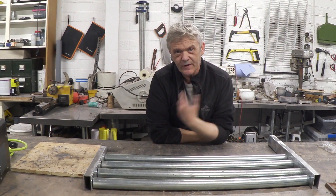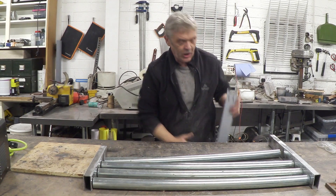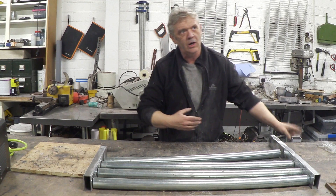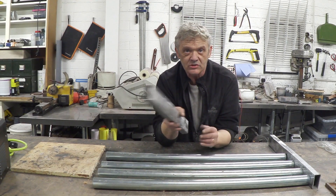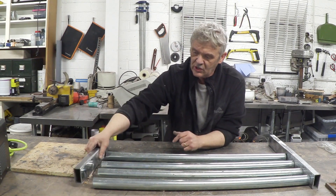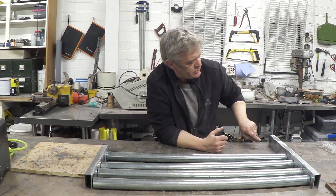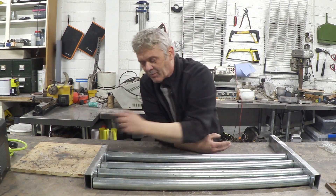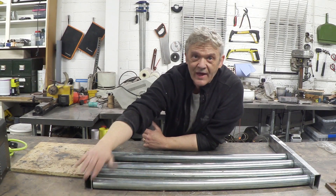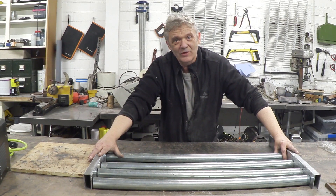For the air cooler I've got these table legs and this square stock, which I'm getting from display stands — 25 by 50 millimeter square steel stock, cut to size. I'm going to drill holes in here that take the table legs, slot the table legs in, give it a weld, and then the top piece — which is longer than the bottom piece — I'll drill a hole in it, blank off the two ends, and it drops onto the particle filter pipe. The gas comes down here, is blocked at the bottom end, has to come down the pipe legs, and exits at the other end cleaned and cooled. I need to cut those holes, drill them out, weld them together, and pop it on — which will be in the next video.